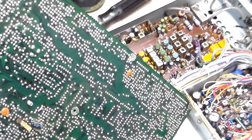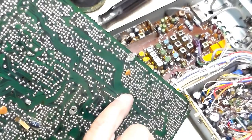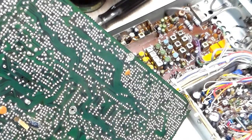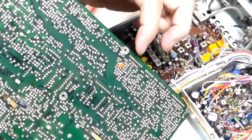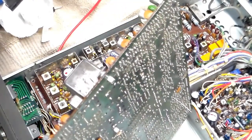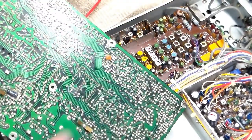Alright, so I don't know how much you're going to be able to see while I'm actually doing this, but it looks like this guy right here is jumper 5, and it goes over to here. So my head's going to be in the way the whole time, so I'm not going to bother filming it. Okay, so there you have it. J5's out, the diode's in, double-checked. Sorry if you're seeing my face, the cathode is pointing toward the resistor, so the cathode's up.